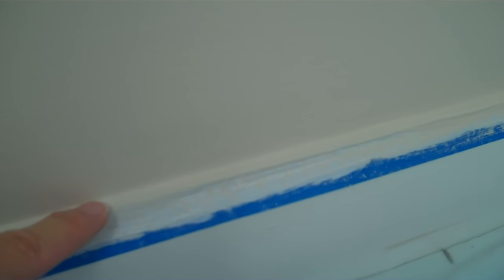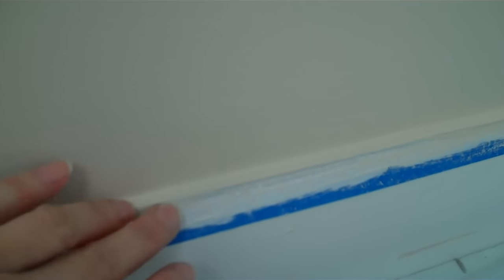Let's show you what we've finished with here. Even though this new wall color isn't very contrasting — it's a mocha — you can see it's different from the white trim. I taped it and used the trim color on the inside edge of the tape before painting the wall. That sealed it so any bleeding that got on the trim was the color of the trim. Therefore, you won't have any colors you don't want there. When we pull the tape off, you can see that just as perfectly as you could possibly want — a beautiful, beautiful edge.